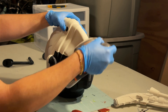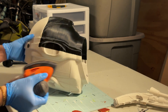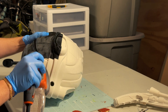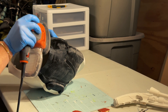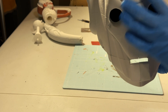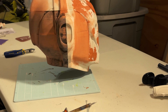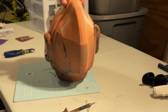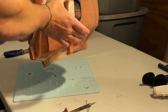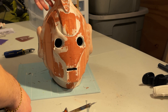I'm using 80 grit sandpaper and going over all the different areas. It really helps take down a decent amount of the layer lines before we start throwing in some Bondo putty and filling in the bigger cracks and crevices that we have from gluing and soldering. And here it is after sanding — it looks still pretty rough, so that's why we're going immediately into the Bondo filling. I did the back with 120 grit sandpaper and now we have the entire front to cover because there are still some pieces there.